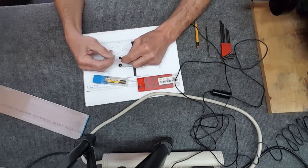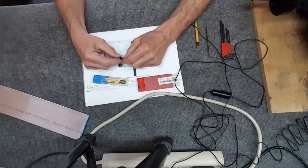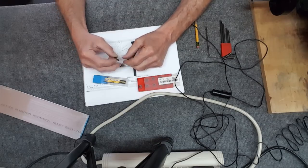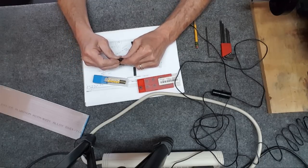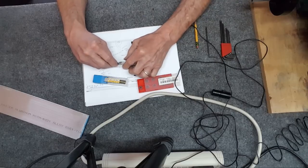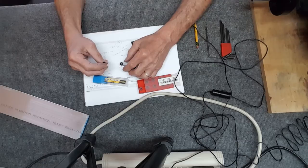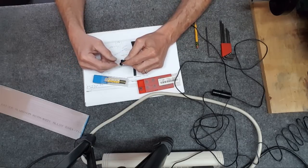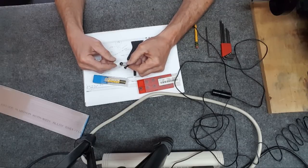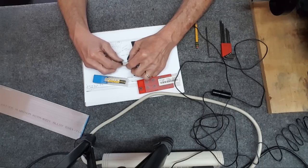So now, how to cone this thing. I was figuring I can probably double nut this. It's a 4 millimeter screw, because it's not sinking in there as is, right? Yeah, no. So it's not going to center it up. I have no choice but to make a cone out of it. So I guess I'll just double nut this, and I just got to start touching it in a 3-jaw, angle the compound, and get this kind of funneled, and then I can try this out and see how it works.